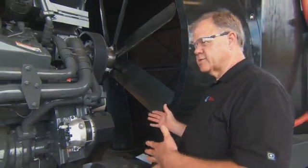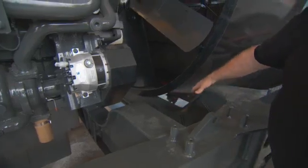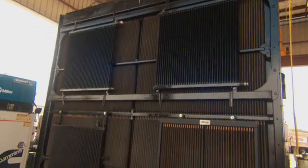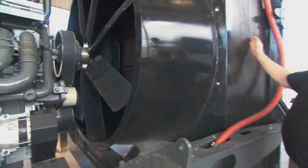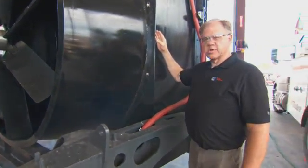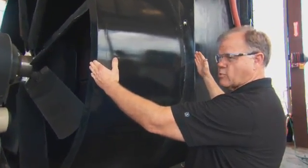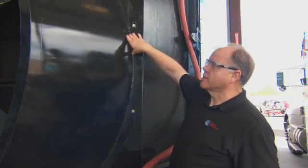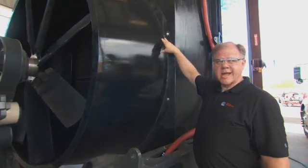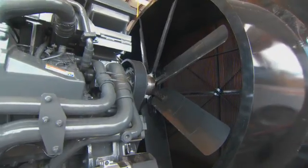Because the engine is a 16-cylinder engine versus a 20-cylinder engine, you can see how much shorter our engine is. The radiator is the original radiator from the T282 truck. This shroud area is the original shroud, and what we fabricate during this conversion is basically this tunnel portion that helps us account for the length differences. The MTU engine would use a 96-inch diameter fan, and we're actually utilizing a 78-inch diameter fan.